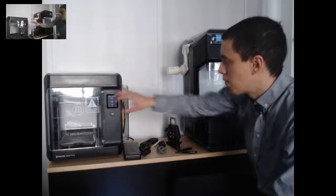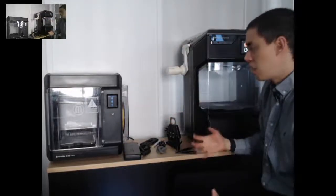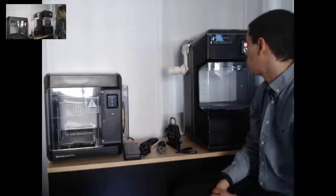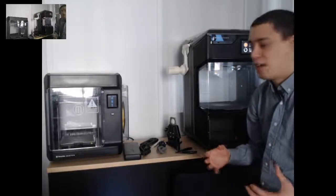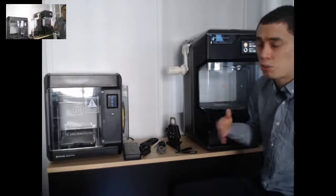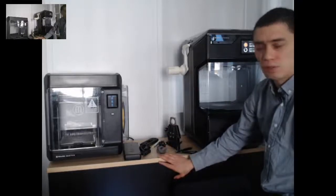What I mean by that is, if you think about both of them, mostly on the Method though, the way that the gantry moves back and forth, that's a relevant weight. It's probably going to be about, let's say, a pound of components moving around. And as it does that, if you have a wobbly surface, the surface itself will just multiply the movement of the printer, and you will end up having this kind of ruckus of a setup where you could compromise the print quality of it, but ultimately it's just going to be super annoying to hear it moving, hear it wobbling, and it's just not great, right? So big surface, about 20 by 20 inches, just to start. Make sure that it's sturdy.